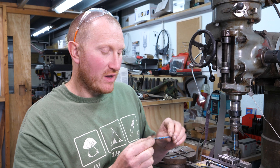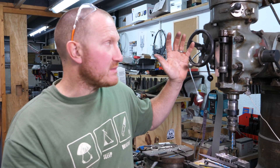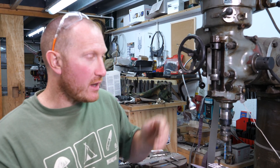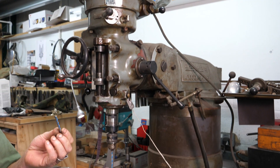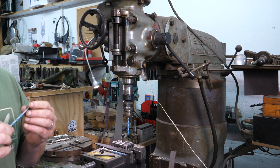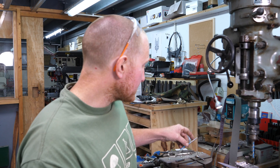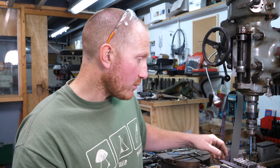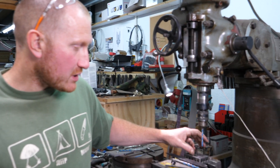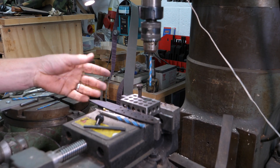The only thing I've found with these multi-material drills is you need to run them really fast. I tend to use one of my mini machines just because the RPM is higher — I think you probably need at least 2,000 to 2,500 RPM to actually get these to work. If you use them any slower than that you'll find that you just break those carbide tips off. I've got the 6.5mm chucked up in the milling machine with a little 1-2-3 block in my vise.